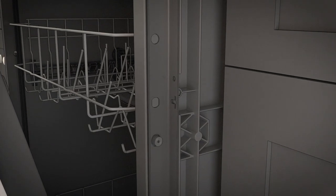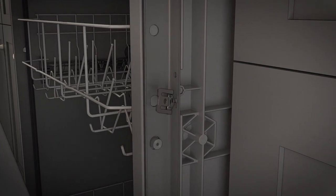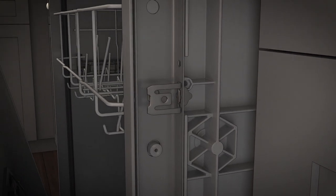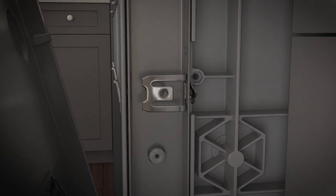Break off the front portion of the brackets with pliers at the location shown before attaching it to the dishwasher. Then install the brackets by inserting the tabs through the slots on the tub frame as shown. You may need to work the tabs through the slots. Using pliers, bend and twist the tabs to secure. Again, we highly recommend using the sides of the countertop for installation.